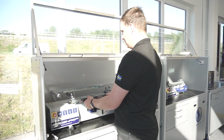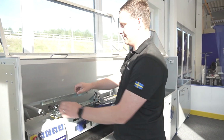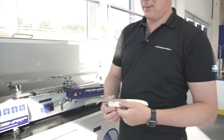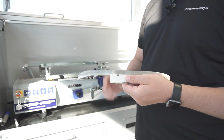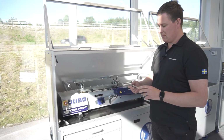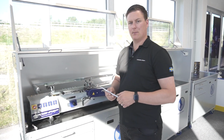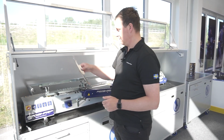After profiling, we want to check the blades, how they look. So we remove the template, and then we check the blades. Sometimes you can get an edge or a bump on the toe, and then you want to blend it to remove that. What you can do on the self-centering machine with 2 blades in one go, you have the blade on, you have the wheel on flat.